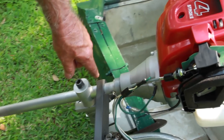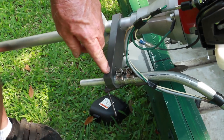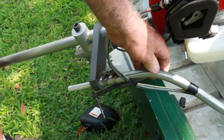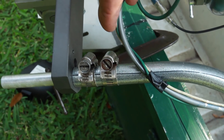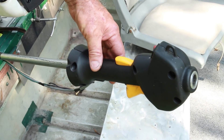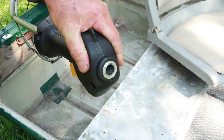I made a bracket that slides over the one-inch shaft, and down at the bottom of the bracket there's a quarter-twenty bolt that holds it in place. I also made a piece of half-inch aluminum bar stock with a screw on the bottom to hold it in position. Then I got a piece of half-inch EMT conduit and used a couple of hose clamps to clamp this on. I also had to make an internal bushing for this. Going up the handle, this is a throttle handle off of a regular weed whacker, and I made adapter bushings to size it from the half-inch conduit up to the one inch needed to clamp the throttle control mechanism on.